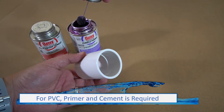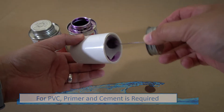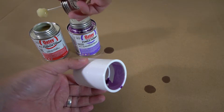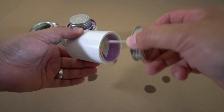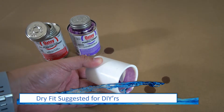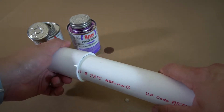The next steps will feature the use of PVC pipes with slip connectors. Since the system is under pressure, you must use primer and cement when putting these connections together to avoid any leaks. If you happen to be a DIYer, it's suggested to dry-fit all of your pipe connections first, and then glue them after you've got all of your cuts and connections made.